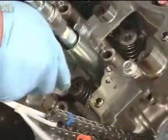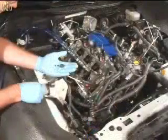With the valve component removal tool, compress the valve spring. The magnets in the tool will capture the keepers and retainer. Remove and mark the valve spring to ensure it is not reinstalled. Before installing the new valve spring, ensure the valve spring seat is still in place. Then install the new valve spring.